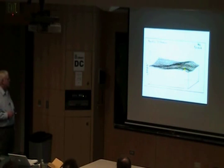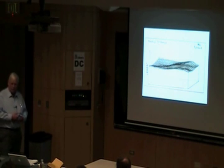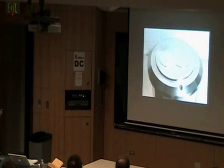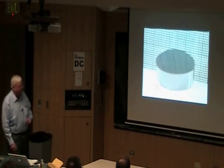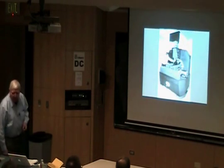And gosh, what year were we doing that? We sold the product in '86, but we got this done a little ahead of that. Anyway, we made a lot of tools like this and molded a lot of parts. This is what a part might look like, reflecting a piece of graph paper, so you can see it's not exactly a flat from the distortion of the lines. And that little piece pushes out of this polishing holder and goes into the mold. There's another one, similar idea, slightly different shape. I think this was actually slightly earlier. But you can see it's a free-form surface.